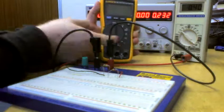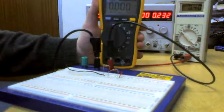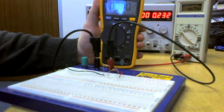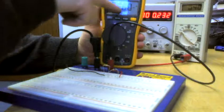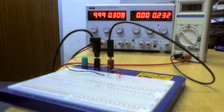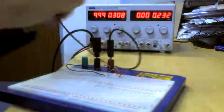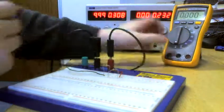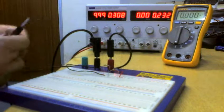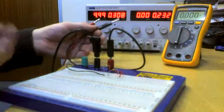Here's our Fluke meter. It's auto-ranging, and our current ranges are down the bottom here. First select it onto the current range — we're measuring in amps on the Fluke. Let's switch the power off before we disconnect anything. Get rid of our Beckman and plug in our Fluke. That's measuring amps — you can see it's measuring DC because it states DC. It's auto-ranging, just one scale, and on this one it's only got one amp socket. It actually ranges itself — even less sockets, even less worry. Red goes to your amp socket, and current flows into the amp socket and out of the common.